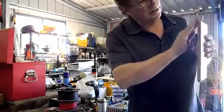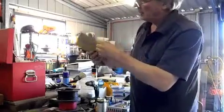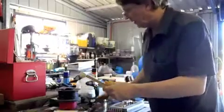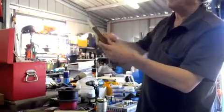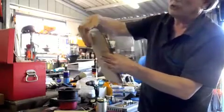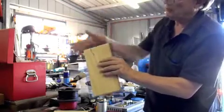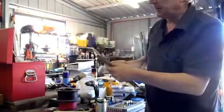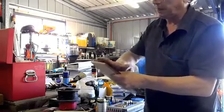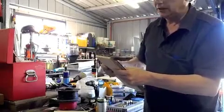Edges are nice and smoothly rounded. Only 3 edges, the other edge doesn't matter. So that when we apply heat to our cover, we can just gently curve the edges around, just using a piece of timber to prevent any burns on your hands, and just hold it in position until it actually sets.